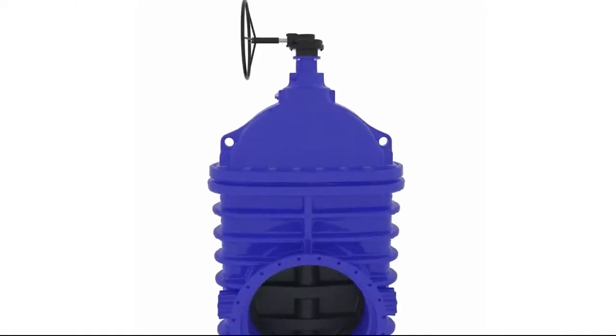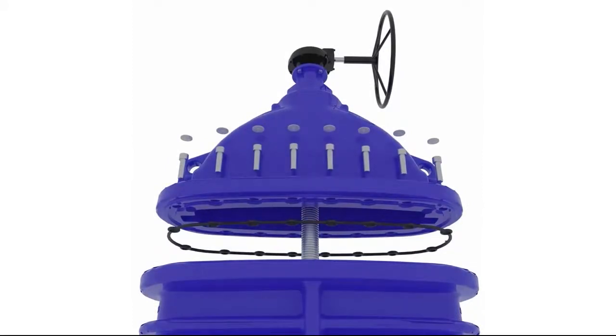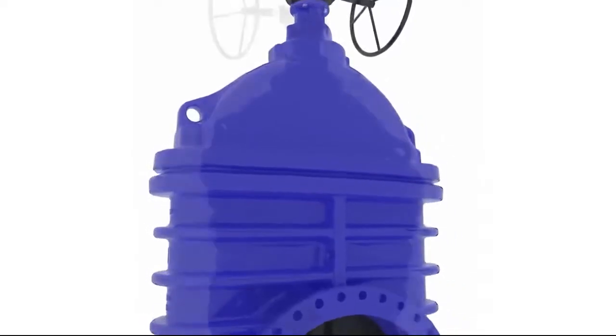And so here you can see, we'll get into the glue and the hot melt that sits on top of the bolts, which you can see there. And then as this explodes out, you can then see the gasket. You can somewhat see the recess and you'll be able to see it closer once it goes in there. And then watch as it goes back together and you can see where each bolt is surrounded by the gasket as well as completely encapsulated inside the body of the valve and the bonnet. And so your bolts will never see anything exposed outside of that valve. Any corrosive soils or corrosive materials in your soil, your bolts and your gasket for that matter just are never going to see them. And so you can see as it goes back together, completely encapsulated inside your valve.